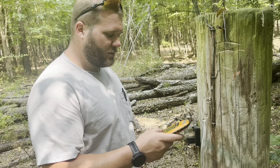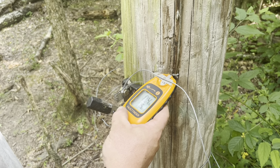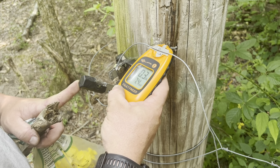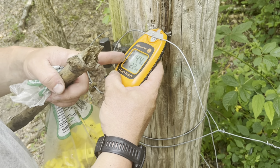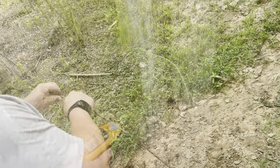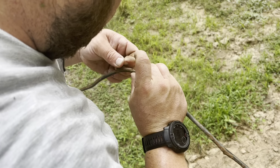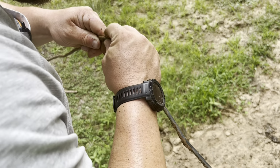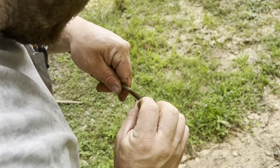I'm using this Gallagher fault finder to figure out where our shorts are at, and you can see with this turned off, your amps ain't pulling nothing, but you got enough voltage on the other side. But then when you click it on, you're pulling a lot more amps, and it's just telling you you're grounding out somewhere down the line. Right there. So is it just split? Yep.